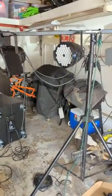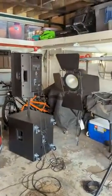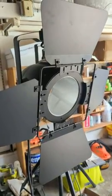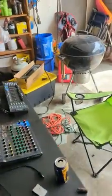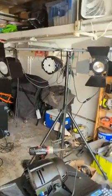When I first hooked the lights up to the DMX cables they will turn on briefly and then shut off. And one thing that I've also noticed with this last light, the LC002HB — occasionally and randomly it'll just turn on for a couple of seconds and turn back off without touching any of the faders on the controller. So yeah, something here is kind of funky. I would appreciate any kind of help. Let me know what you think.